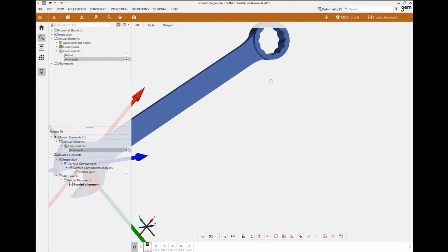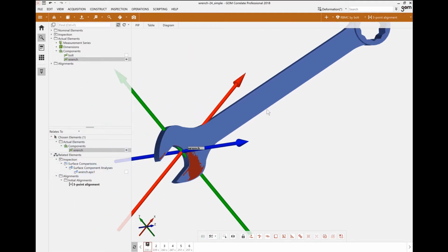Okay, to do a comparison from a DIC analysis to an FEA analysis, the first thing we need to do is inspect both meshes to see the major strain, 1 from the DIC data and 2 from the FEA data. So I will go ahead and inspect those 2 elements. To do that, right now I only have a fixed element, so if I look at every stage, the CAD file is not moving, and that's normal. I want to import now the deformed mesh for every single loading in that project.